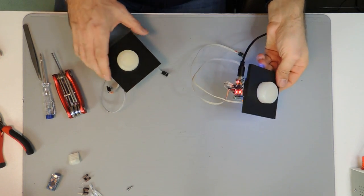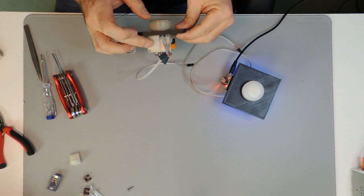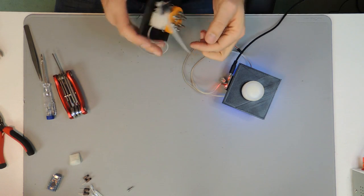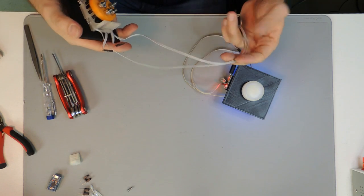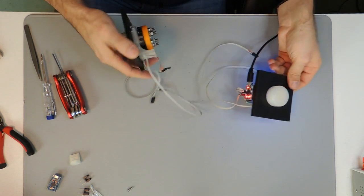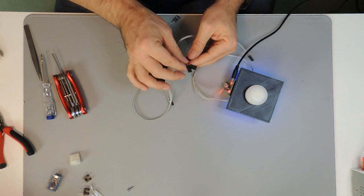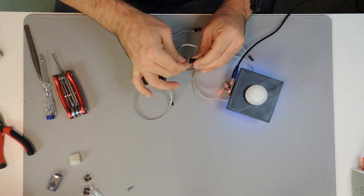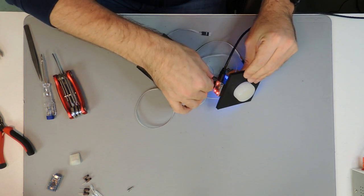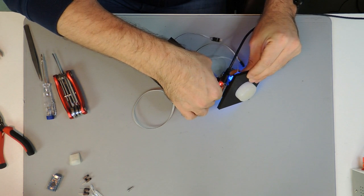Well, if this is your second spinner, you don't need to have a second microcontroller. You can, as already explained, attach the sensors and all the NeoPixel LEDs to the first one that you already have installed. I'll just show you how. Use the two connectors of the two sensors of the second spinner. Apply them to the two connectors.